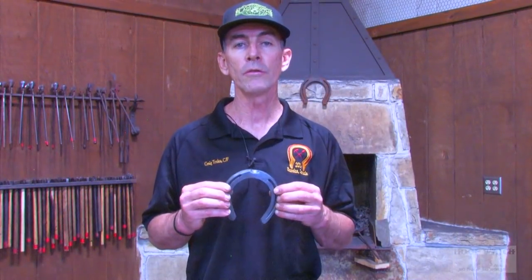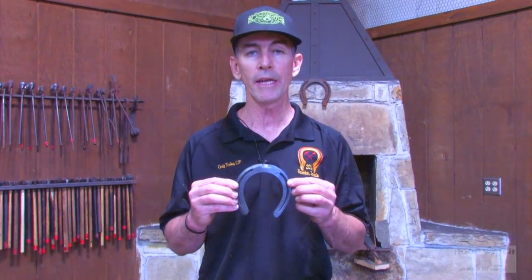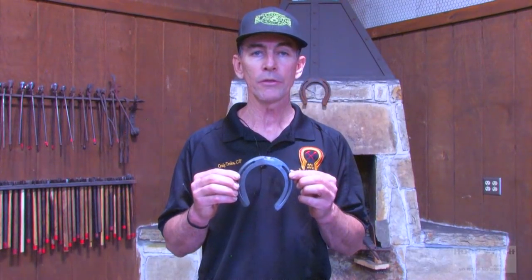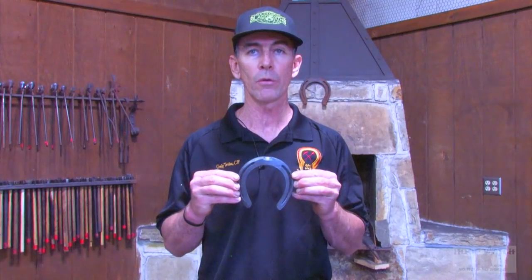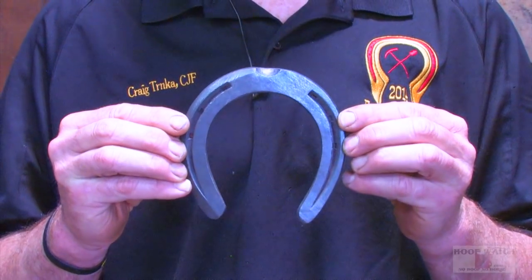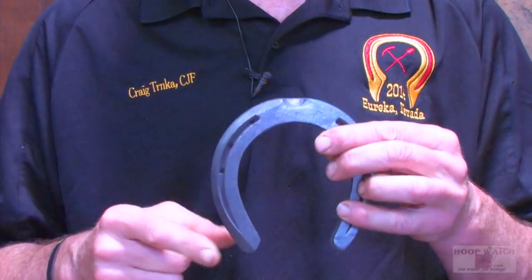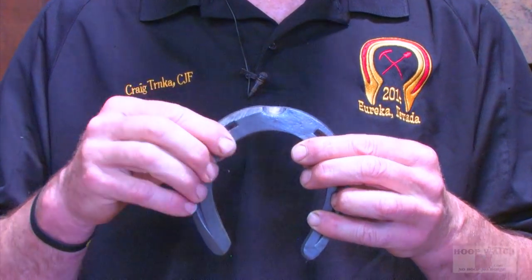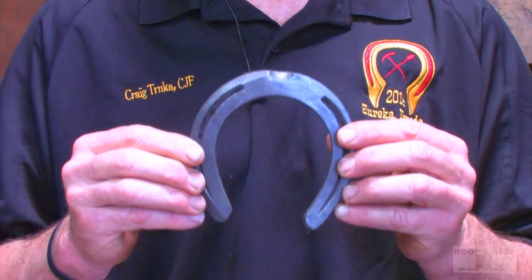Today we're doing the Vulcan Horseshoe individual class in Goshen, Connecticut, and one of the shoes we'll be making is a lateral breakover or sidebone shoe made out of 12.5 inches of three-eighths by three-quarter. It measures five and an eighth square, it's got a hammer-drawn toe clip, it's safed on the lateral side on the outside of the fuller end, it's a wedged medial heel, and it's fullered for five slim blades.